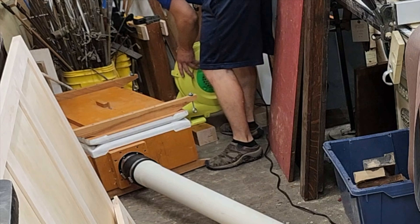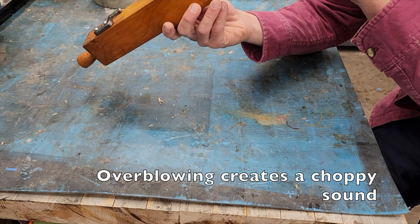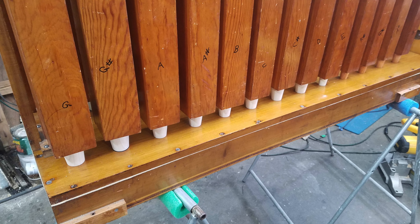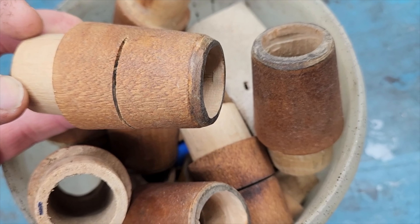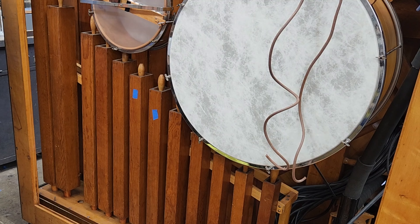I connected the blower — yes, it's a bounce house blower. With everything hooked up, the bass pipes could be tested, and of course there were issues. I wasn't able to record the testing because it involves a lot of stopping and starting, so we'll do a quick demo and an overview of some of the things I found. One issue was the pipes over-blowing or receiving too much airflow. The size of the hole in the toe regulates the flow of air into the pipe, which determines the volume or loudness. The original toes on these bass pipes were modified by a previous owner, so I made new ones last year. I was given measurements from a friend off a similar size photo player, but they still needed some dialing in.